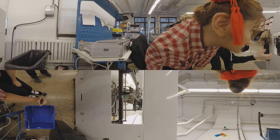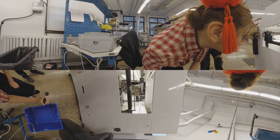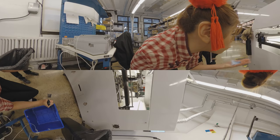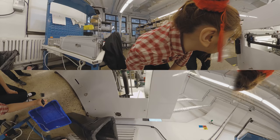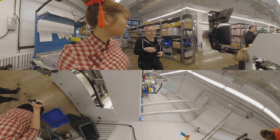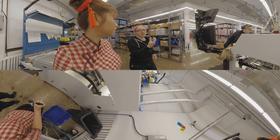From here you can get a good view of it as well. It's very precise. The XY movement is really beautiful. There are two nozzles — one big and one small — so sometimes it does bigger solder joints as well. It's flux from below — the silver thing closer to us is the fluxer. Because you saw the bar solder, it's solid — there's no flux in the center — so you have to do it in two steps. Also there's nitrogen from the nitrogen generator coming out here. If you get pure nitrogen around the solder, it makes for cleaner, very shiny, clean solder joints. It looks really nice too.